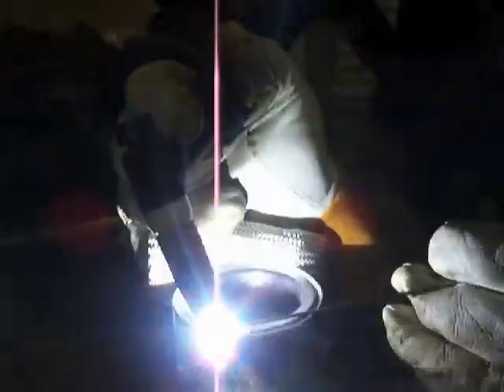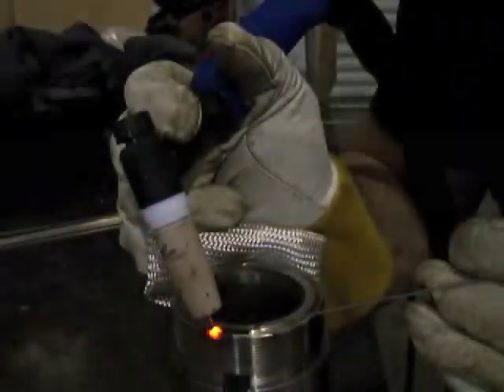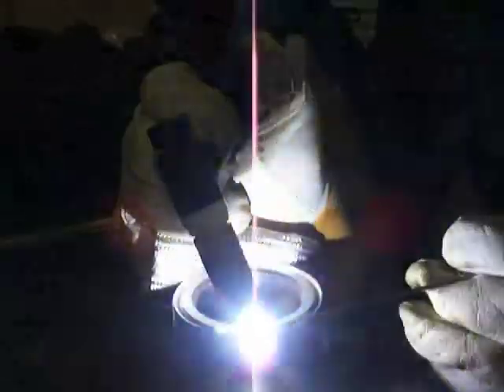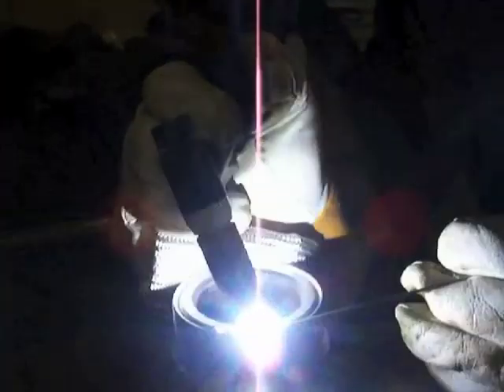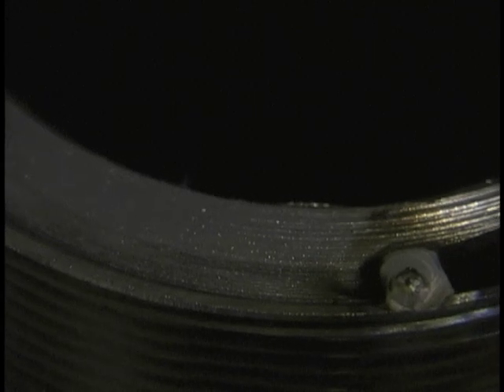The first thing I want to do is get a tack right where this keyway slot is. That keyway is going to be cut out when this is all done, so I've got to get a good weld all the way around it, and then a little bit of weld on the other side too — because even though this is a press fit, when that slot's cut it's not going to be nearly as tight. I tacked it on the keyway slot. I want something to weld to and weld from, so I always leave a few little extra drops of filler metal at the end, and that gives me something to weld up to so I won't roll metal over into the slot and have to grind it out later. I want to do this in one shot.